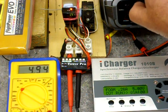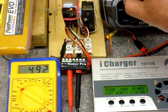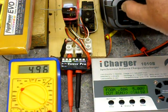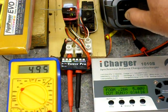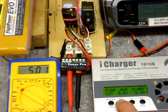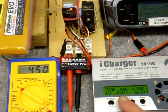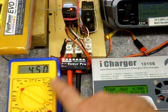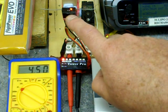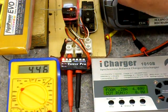You can see the volt spy will flicker into the red as the voltage is being depressed down to 4.9 or so according to the meter — 4.93 on the left, still fine. We'll drop the voltage further. We're now at 4.5 volts as confirmed by both meters. The volt spy is now in the critical red. The receiver is still happy and the servo is also still happy.